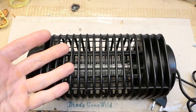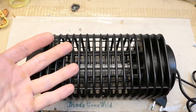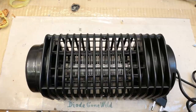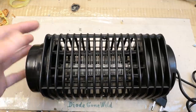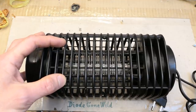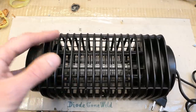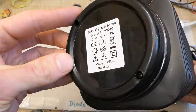Fluorescent tubes used to attract insects are usually ultraviolet at 365 or even better 350 nanometers. LED-based ones typically have violet LEDs at around 400 nanometers, which is more violet than ultraviolet, and very often produce so little light that they don't even attract anything. So a fluorescent tube is actually a good thing here.